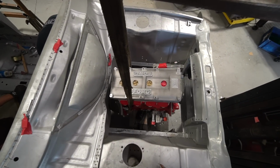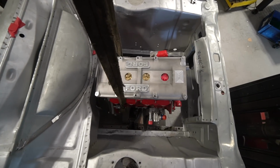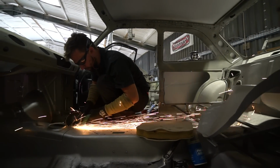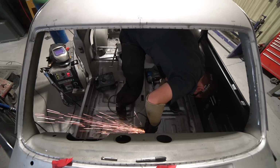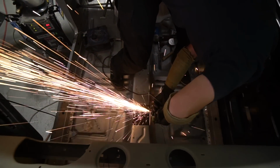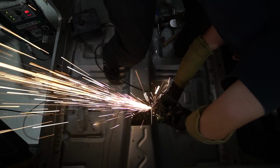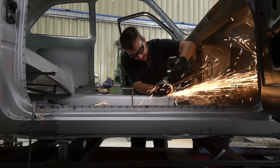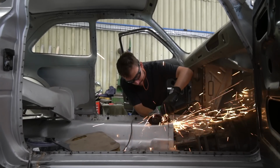There's one little bit of the bell housing that was a little bit tight on the bulkhead. We're using a standard, in inverted commas, Escort big tunnel pressing on this, and it does clear the Mazda gearbox. It doesn't clear the shifter turret, so we'll build a turret on the top of the tunnel, unlike the ZF gearbox Escorts. We'll build a bit of a ZF shift tower type affair for that, which I think will look quite nice, and that'll clear the shifter section.